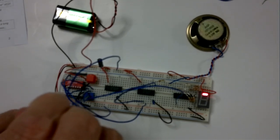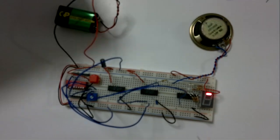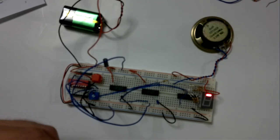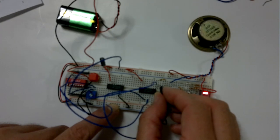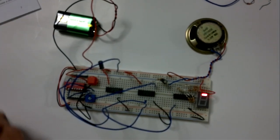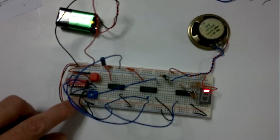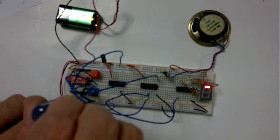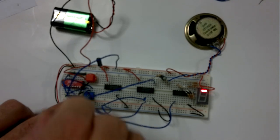That is just a nice quick circuit. Now the last part of the sheet suggests putting a 10 microfarad capacitor onto the control input. When I touch it, it goes a bit hummy because it's very sensitive. That goes to our zero line. So while the capacitor is charging up, it really affects the sound. If I change the voltage, there's a really long delay, because the high resistance of the variable resistor means it takes quite a long time to charge and discharge that capacitor. That's quite useful.